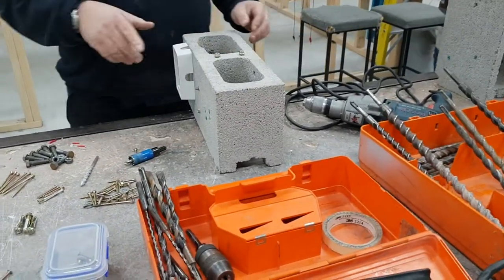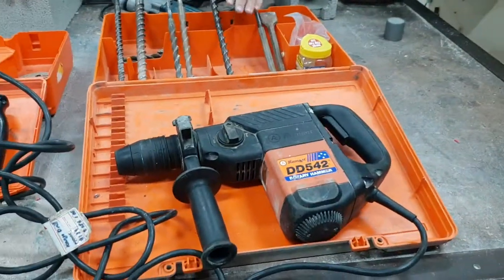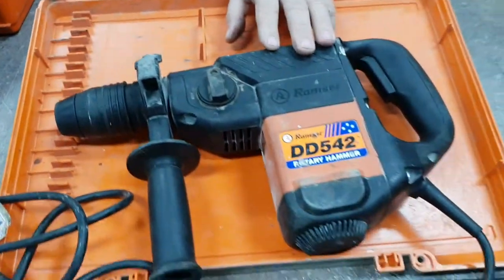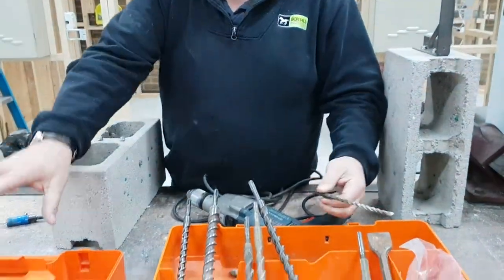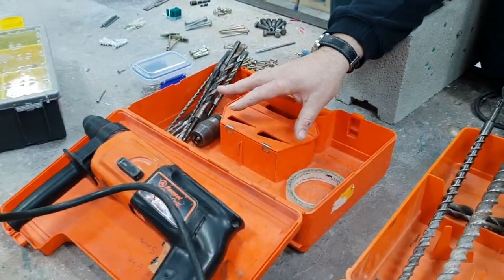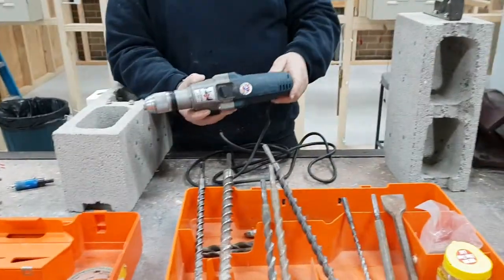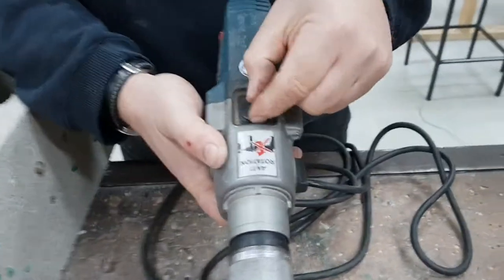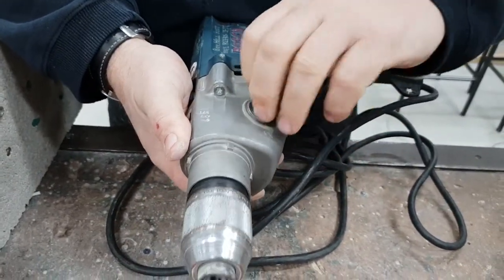If you zoom out, we've got two drills here. I've brought my big one in. This large one is used for more industrial type stuff and is probably the more expensive one you would buy. Over here we have a Bosch electric drill — this is a universal drill. It's a 1000 watt normal domestic drill. It has a hammer action. Up here you have anti-rotation, so you have hammer and normal drilling modes. You also have two speeds — high and low.